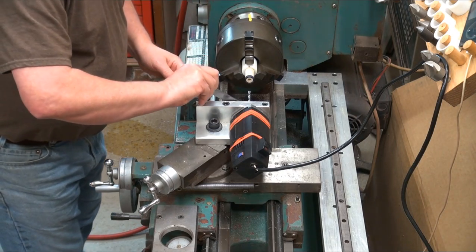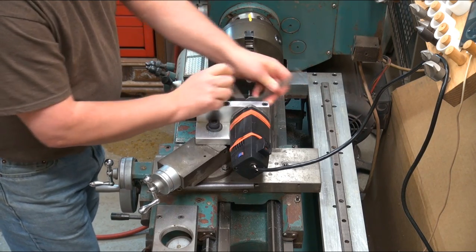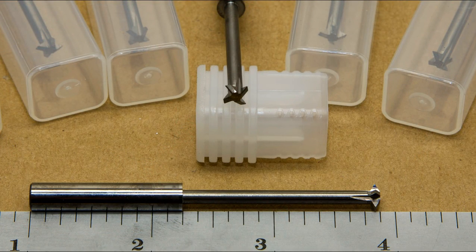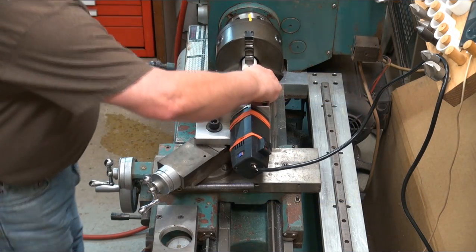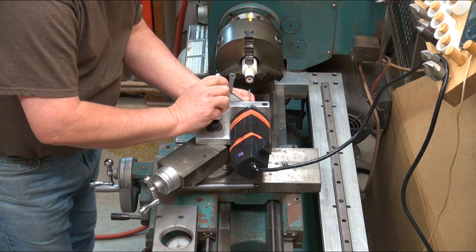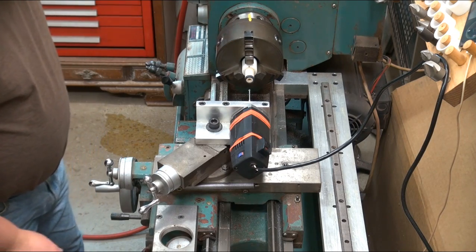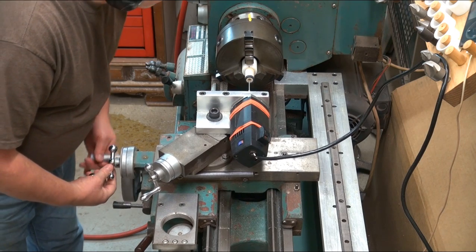Time to change to the threading tool. These are the tools that I had made, and this is a further modification I made so they'll work on joints too. I'll lock it in and get ready to thread. Since the cutter head is exactly the same size as my end mill, I know the tool will touch up at exactly the same setting I finished the bore at.